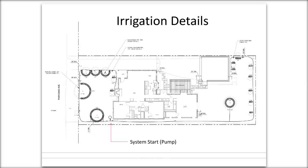So this is a number of fruit trees and shade trees. They're all being irrigated with gray water. And in California, the gray water code dictates that you are not allowed to go right up against buildings and up against the property line. So the inspectors are going to be looking at, are you respecting the setbacks from property lines and structures? And also they're going to look at the total area of irrigation. So one of the concerns about gray water systems is you don't want to put so much water out into the landscape that it's running off. So having properly sized mulch basins is going to help with that.